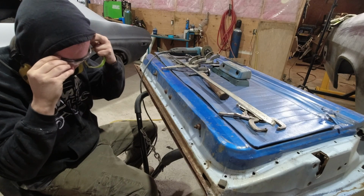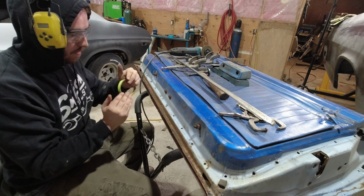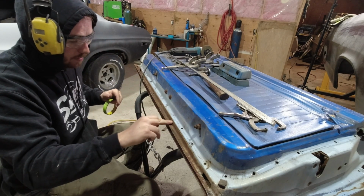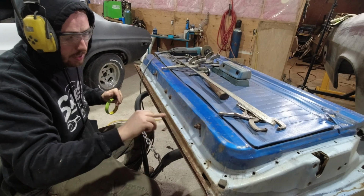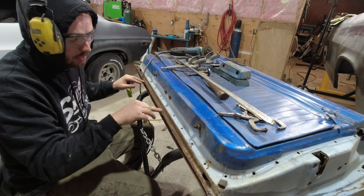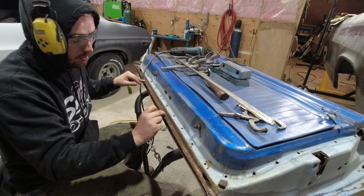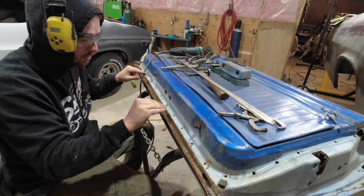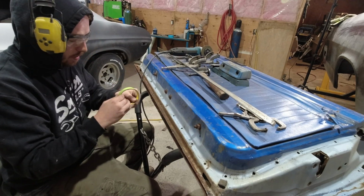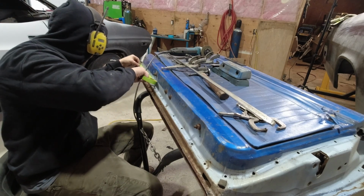I drew a line when it was clamped in there. So because you can see the line, obviously that's above the material. You probably could cut the line because once it's in... No, you can't cut the line. Don't cut the line. Leave the line. Once it's in and it doesn't have that bit of material, it's actually going to sit a little bit lower anyways too. So if you cut the line, you'll have a pretty big gap. If you leave the line, it should be pretty good.